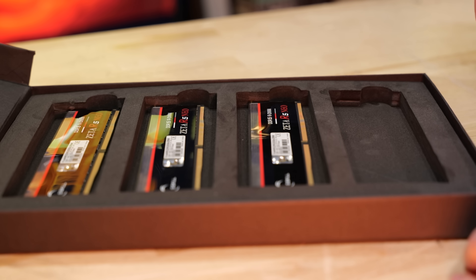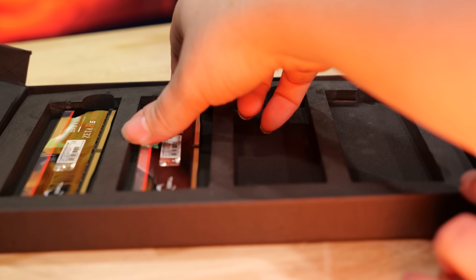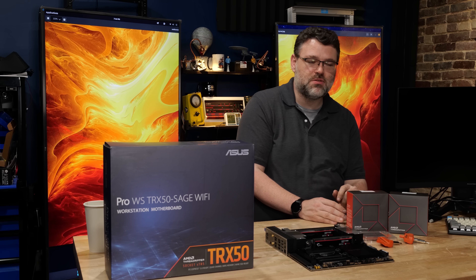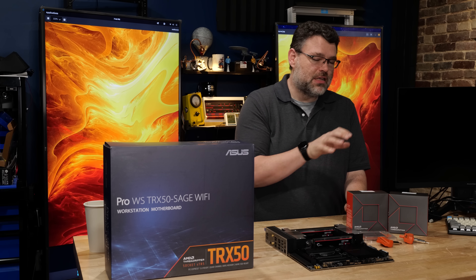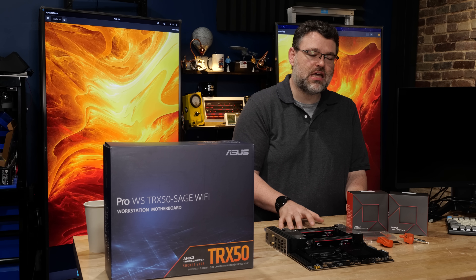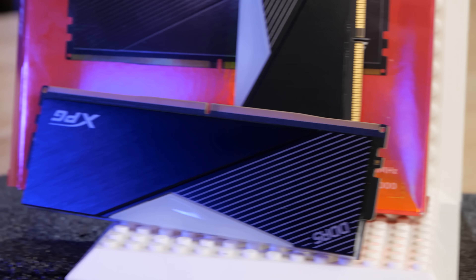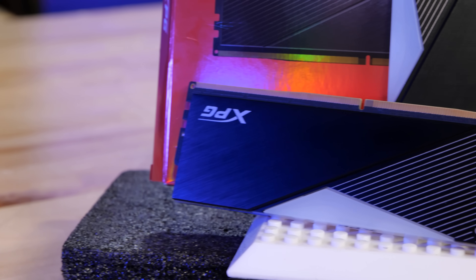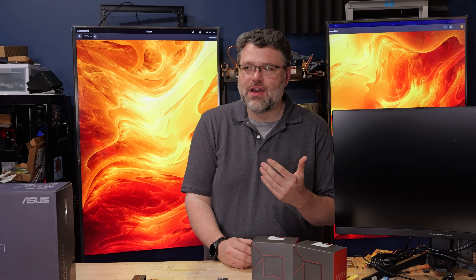There's also a Wi-Fi 6E solution built right in. Let's talk about memory — these are RDIMMs, RDIMMs up and down the stack. Some people might say they really would have liked desktop-class memory on the TRX50, but as an enthusiast and as someone trying to put myself in your position, the answer is no. DDR5 desktop memory and DDR5 server memory have different design goals. Desktop DDR5 is all about cost minimization, and bringing up DDR5 on a desktop platform has been really difficult — achieving things like two DIMMs per channel running at the upper echelons of what DDR5 is beginning to offer.